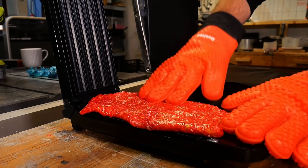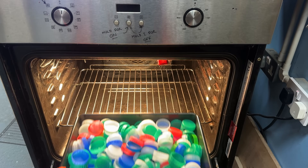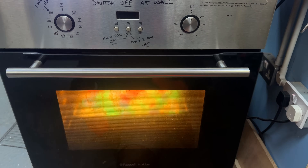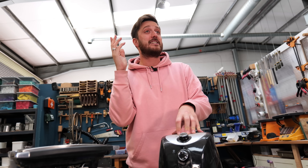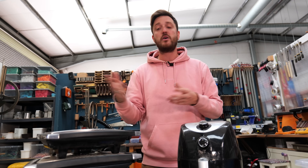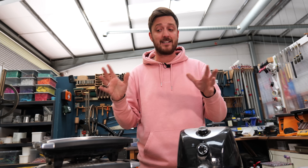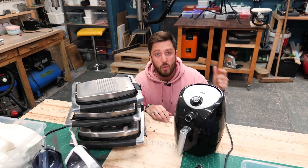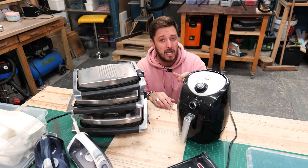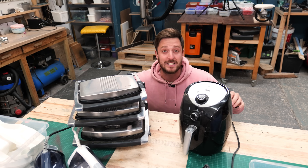In other videos we've tried things like churro makers, air fryers, and we use irons for plastic bags. Basically if it has a settable temperature like an air fryer or an oven, we're not setting it higher than 180 degrees Celsius. And if it's something like a panini press or churro maker where you have no set temperature, we've yet to come across one that goes above the burning point for plastic. Ultimately it's all about problem solving - doing it in a controlled way, trying one bottle top, doing a low temperature and knocking it up a little bit each time.